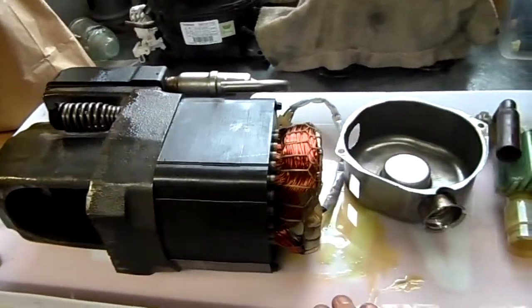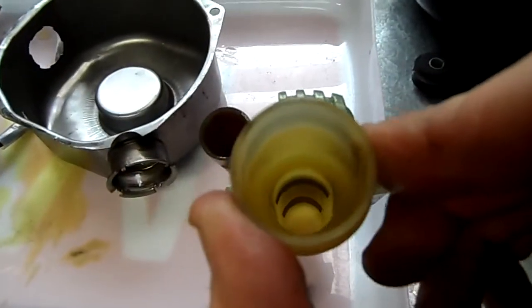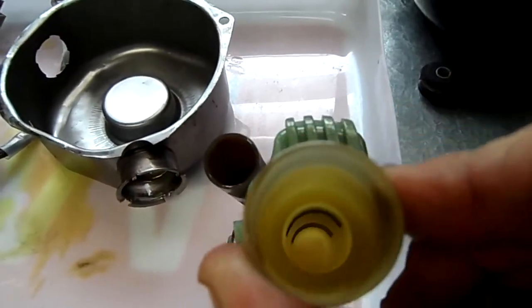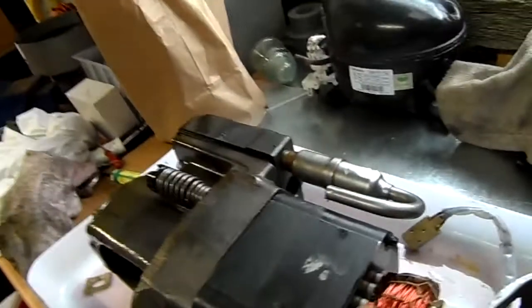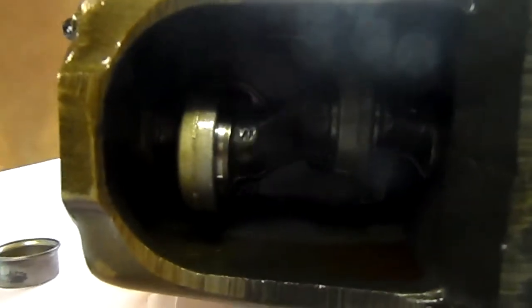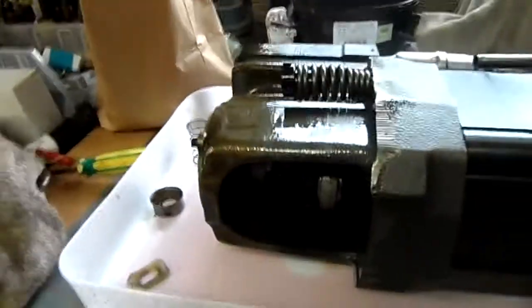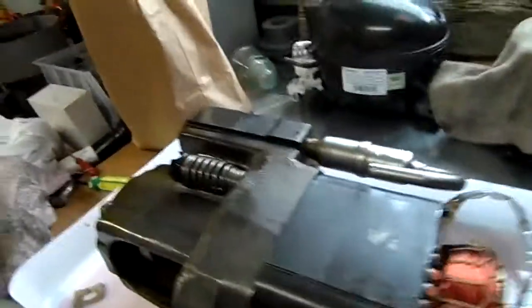Here's the pump assembly and the motor. Taking the cover off and also the suction silencer and intake tube. See those two little cutouts down the bottom here — they're designed to trap some of the noise, make the compressor run a bit quieter. It's a two cylinder, as you can see — two pistons, they look about one and a half inches in diameter, although they're very very stiff, quite hard to turn over. There's the motor stator, stator windings, and the rotor up in there. We'll take the stator off next and see if we can turn it over a bit freer.